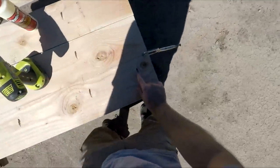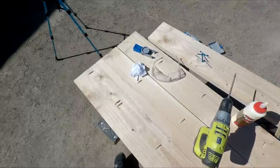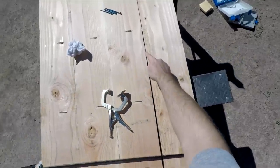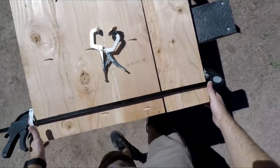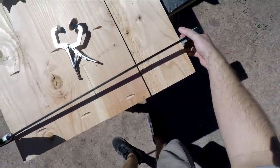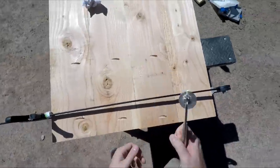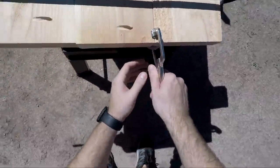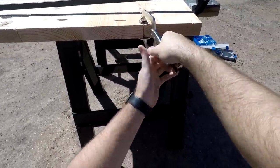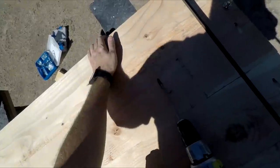These didn't fit together as nicely as I'd hoped. I had to add pocket screws to the ends of each of these boards. For boards that are far off, you'll have to use a clamp. I have a large clamp here and I'll list that in my description. With everything clamped in place and the glue set, screw everything together.